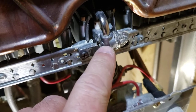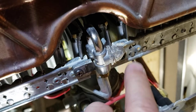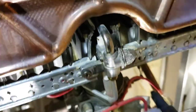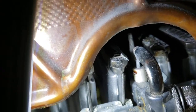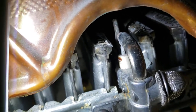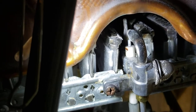Here is where the igniter is, and the thermocouple is behind there. What I did is I took these two screws off on both the right and left side and pulled this out about a half inch to an inch so I could get in and see what was going on. You can see the igniter, and if you look back there you can see the thermocouple sticking up. Both the igniter and the thermocouple were covered with white oxidation powder, and when that happens the pilot light shuts off because it's not generating the millivolts of energy needed.